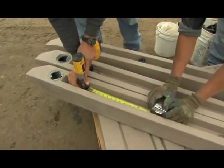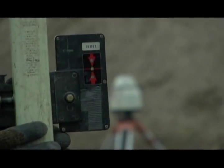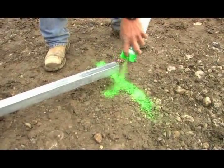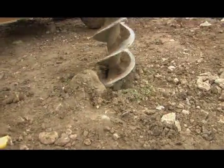Installed brackets provide a leveling point on each post. If a laser is available, it will be an excellent tool to assist in determining grade and slope. For a level ground installation, begin at a corner or an end post — this will give you a good starting point. If there is a slope, it is easier to begin at the top and work your way downhill.